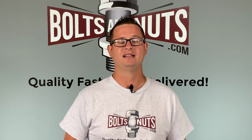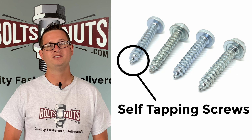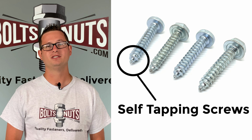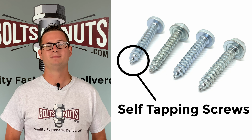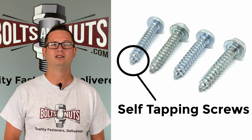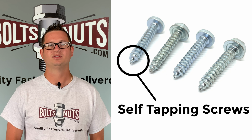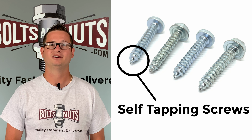The two main types of sheet metal screws are self-tapping and self-drilling screws. Self-tapping screws are used for securing different types of thinner sheet metals and have a sharp point like a pencil. In most cases, they will require a pre-drilled pilot hole or punch hole to get started. Once the threads get started, they will tap their way through the attaching materials.